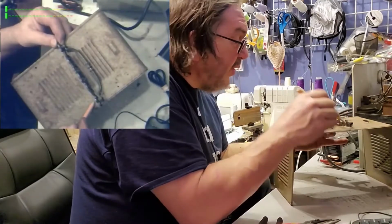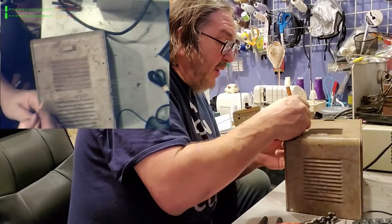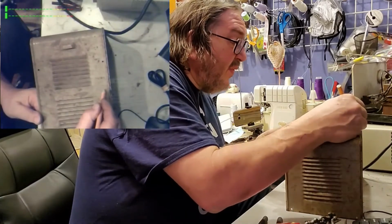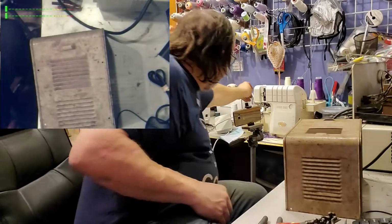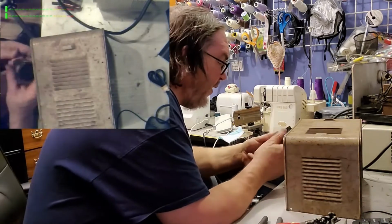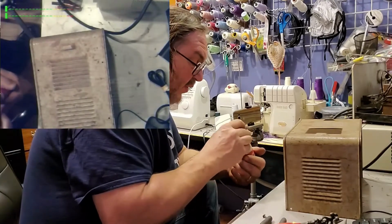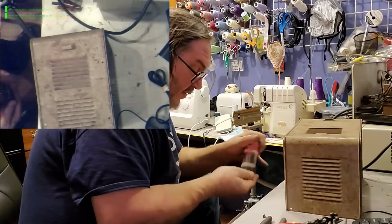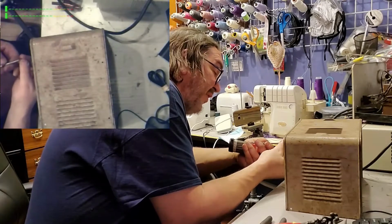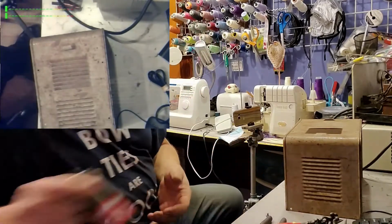I'm looking for where the screw goes in, and there. Here I want to kind of eyeball this. All right. Pick a drill. Try this 15/64. Whatever. Not quite a quarter. This one, the head will not come through. That gives me plenty of room in case I'm not exact. The drill sharp? Yep. Alright.